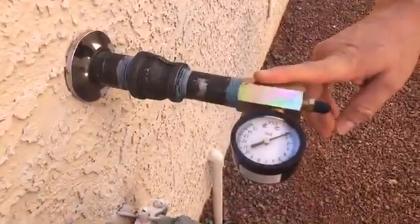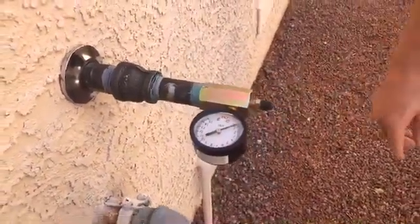Here we've got a gas gauge on the line — this is what we normally do to prep our gas line for inspection. Once the inspector signs off on it and the gas line holds pressure, the gas company will come out and hook up the gas line to the meter. The inspector will tag this gas line, letting the gas company know that it's okay to hook up. It's just a little safety precaution they go through.